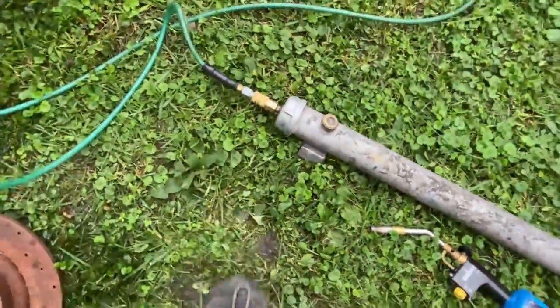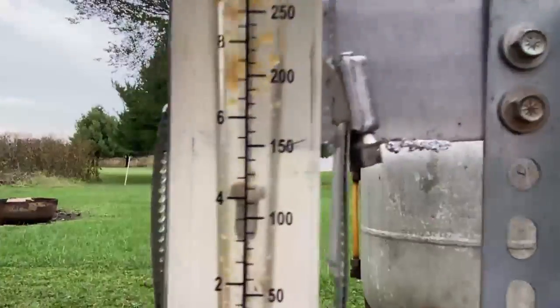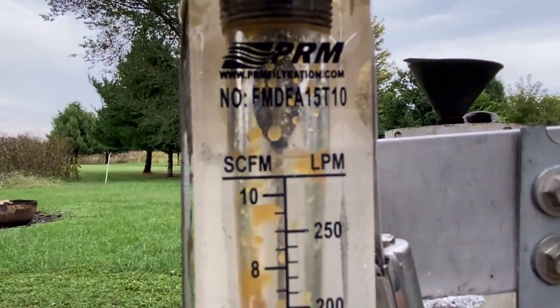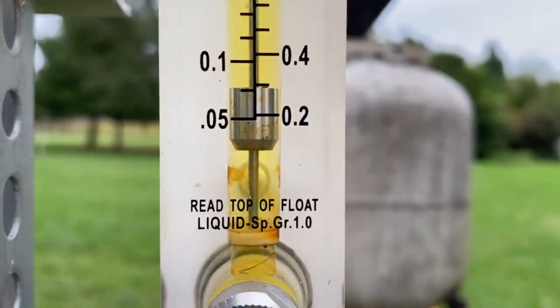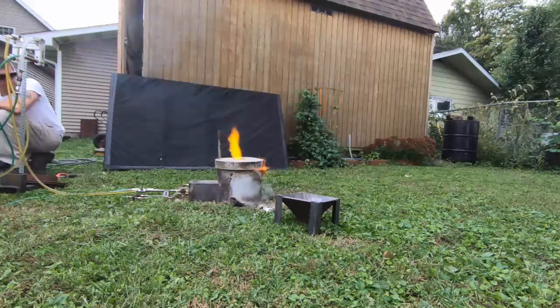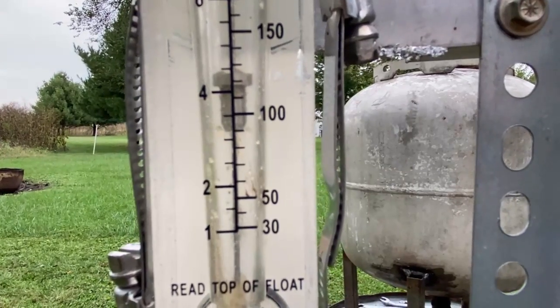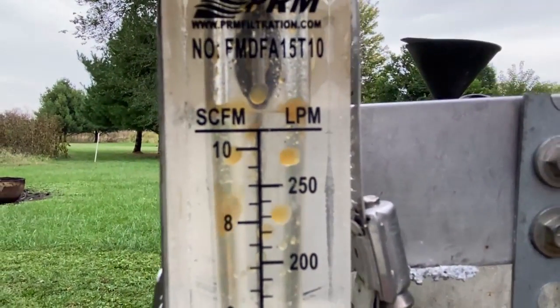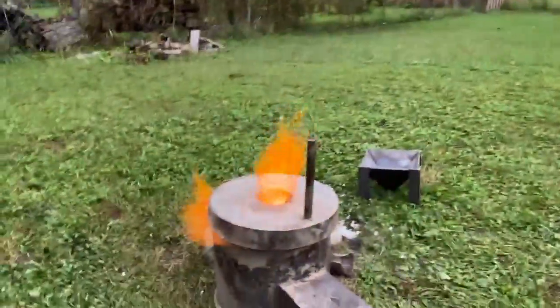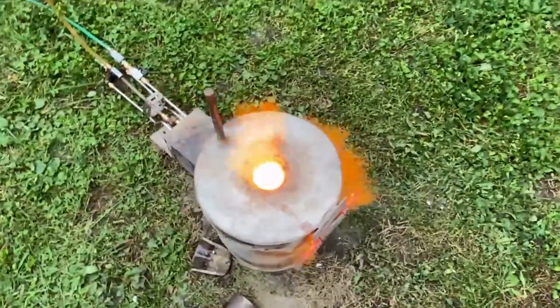I just clipped the inline dryer and look at all the gunk coming flying through there. I went ahead and deleted the inline dryer because it's just saturated with crap. I want to show you something — you see this constant flow of water traveling through here? That is why you've got to have an inline dryer. That's what's traveling through your air hose constantly, and that steam being created is going to rob the furnace of a lot of energy. You have to get that out when you're trying to hit these top temperatures.